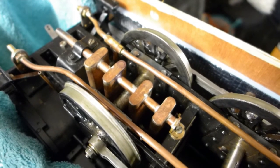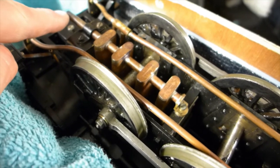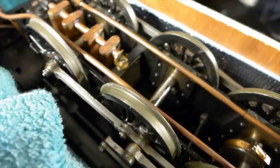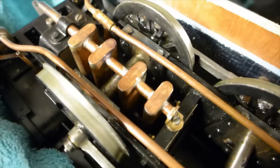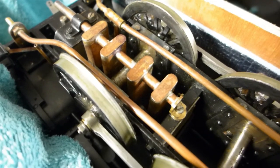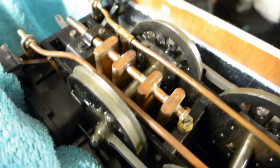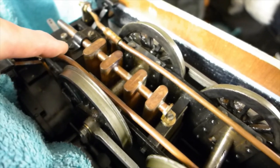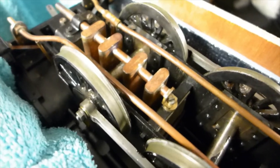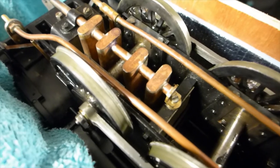So we're looking now at the locomotive. This is the pipe onto which the silicon feed hose connects, and on this locomotive there's four burner wicks. These are oval, but they can be round. They could also be rectangular, but they all follow the same basic principle. And usually this method of fitting with a simple U-bracket is what holds the burners in place, so these can easily be removed. You can take your wicks out and swap them.